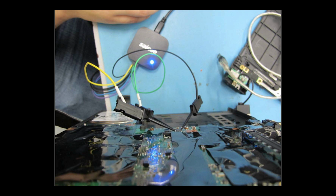And then when you go to initiate a capture, you're going to have to pick a sample rate. The logic analyzer can do anything up to its maximum rate, which might be 100 megahertz, down to like 10 kilohertz, 10,000 times per second. So the general rule of thumb is you want to capture as fast as possible. There's a whole lot of math about sample rates, like the Nyquist-Shannon sampling theorem, which I don't understand at all. So general rule of thumb is sample as fast as possible. I2C runs at many speeds, anywhere from 10 kilohertz to a few megahertz. So it's best to just do the fastest possible.